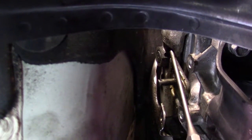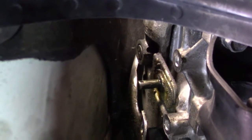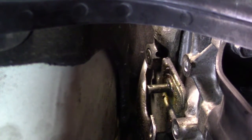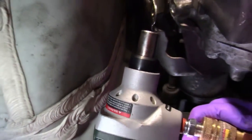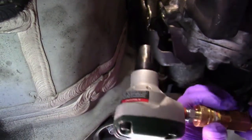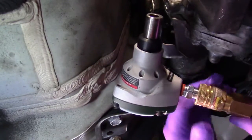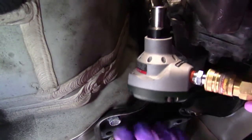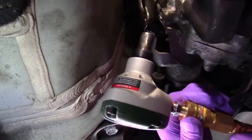We are at the hardest part of the install — we will have to beat out this pin. We've got our 3/16ths punch, and since we are on the ground it is a lot easier to use this palm nailer. This makes the job a lot faster. Once you get the right angle with the pin and the pin punch, just put this on the back and it will do the hammering for us. If you don't have an air gun, they do make an electric version of palm nailers. Otherwise you'll have the super tedious job of using a mallet or a hammer.